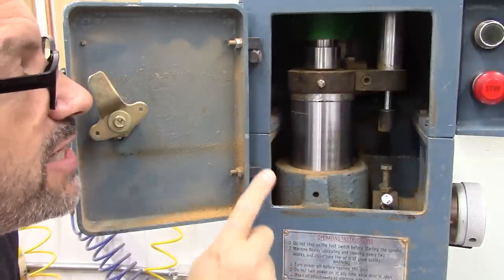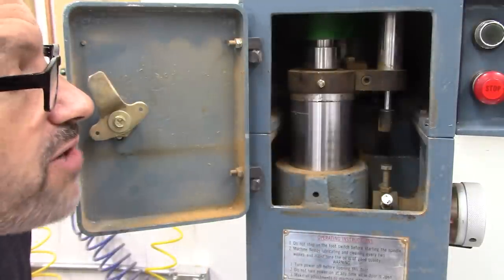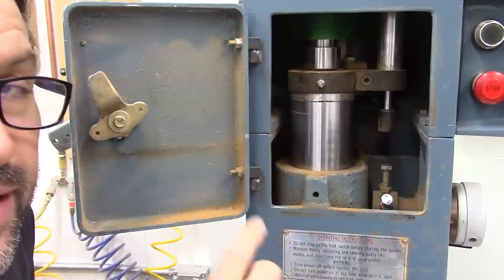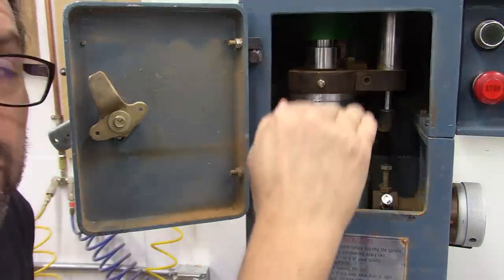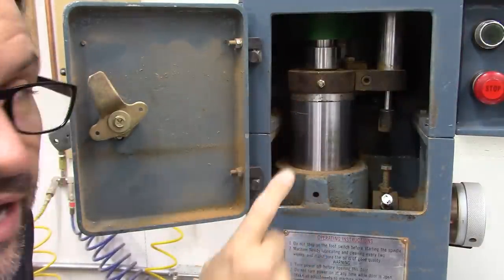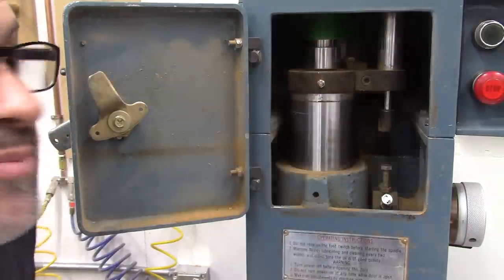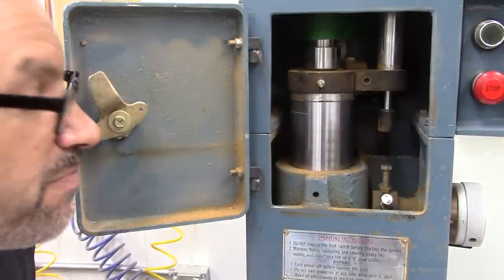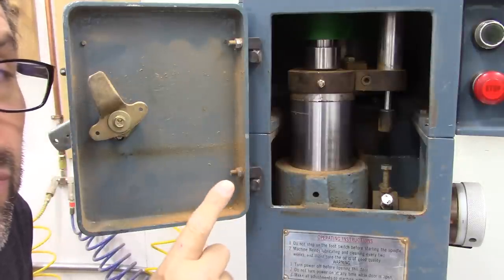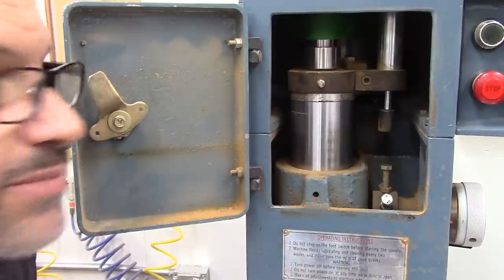And what happens is when everything is spinning, this belt moves up and down on the drive drum in the back that's 5 or 6 inches tall. If everything is spinning, then everything moves up and down perfectly and works great. If the drive wheel is not spinning and you operate the pneumatic ram, it kinks the belt. So what has to happen is this spindle needs to be spinning in order for you to move the pneumatic head ram assembly up or down. I'm going to show you what that looks like now.